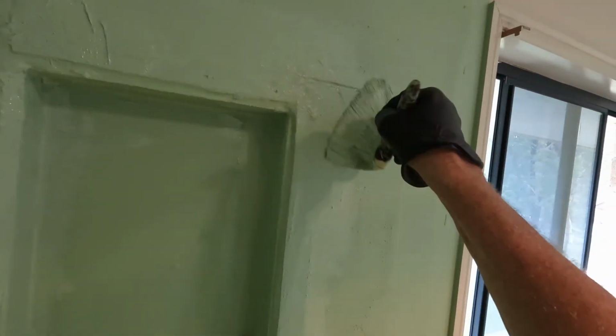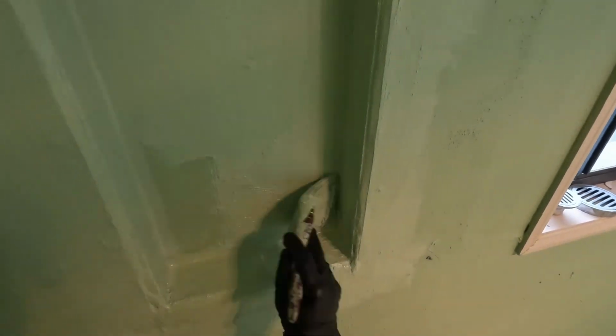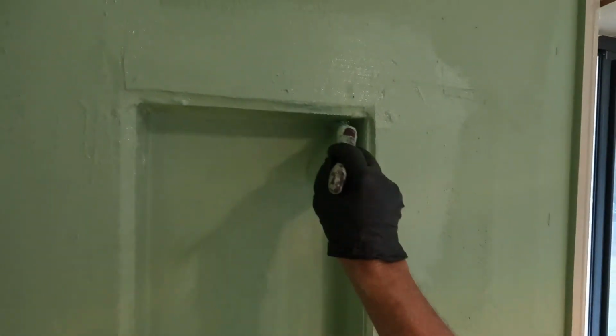You must stick your mud to the floor, otherwise it'll all sound drummy, and that's not good because that's a bad sound. That's a tiler's worst nightmare, to hear drummy tiles if he's laid a floor. He goes, uh-oh. Nah, big mistake. You always stick down your mud to your floor.